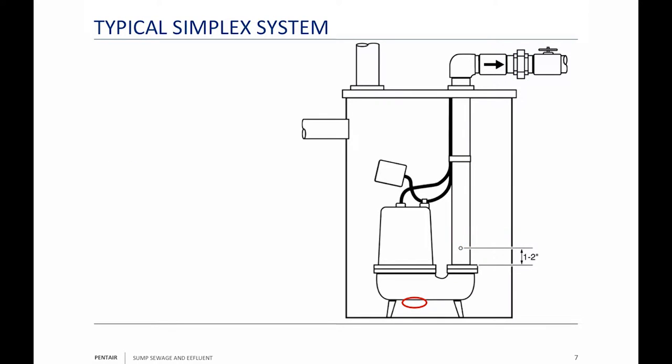There is a two-inch hole in the bottom — since this is a sewage pump — to allow water and materials to pass through. The solids have to be spherical and get pushed right out through the discharge. We need to fill the whole area with water, and that little hole allows us to do that. You'll notice we've got an inlet and a vent. There's only going to be one vent, and it's to get rid of any gases. The vent must go all the way up through the building and out through the roof — you don't want those gases collecting in the building because somebody could get killed.